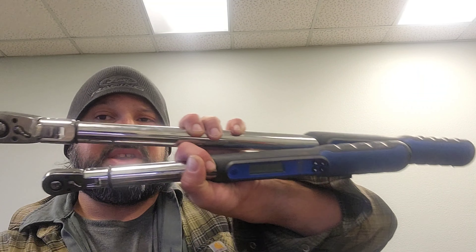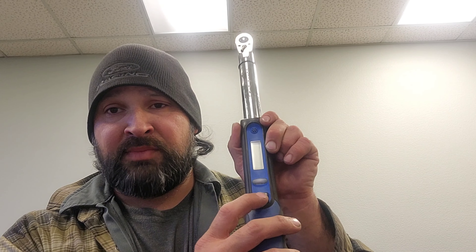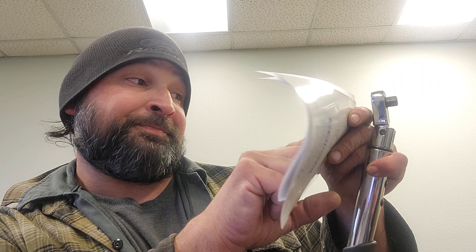The other two we have — same thing, three-eighths and half-inch — are CDIs. Half-inch and three-eighths with a little push-button quick release, which is nice. I don't believe they do angle. You've got your up-and-down scale and your units, so you can go inch pounds, newton meters, and foot pounds. I honestly don't like the flex head on these — it's useful for automotive but we use ours for non-automotive, straight-shot applications. We keep these in their cases with all their paperwork, and these are rated at 2%, which is the big difference when talking about torque wrenches.